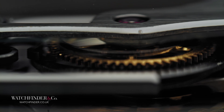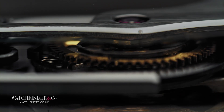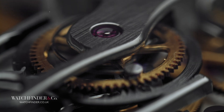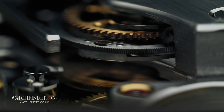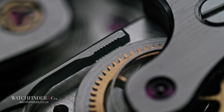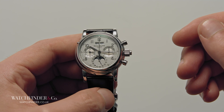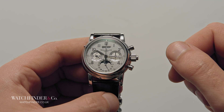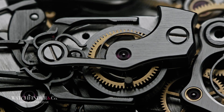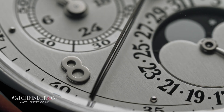Here is how it works. The drive from the chronograph second hand turns a cam — similar to the cams that reset the chronograph — which has a little notch in it. In that notch sits a ruby roller on a lever, which itself is connected to the split-second wheel and held under tension with a spring. When the split-second wheel is free to turn, the roller sits in the notch of the cam and receives the drive from the chronograph seconds, synchronously turning the split-second hand. When the split-second wheel is clamped still, the cam continues to turn, with the sprung lever allowing the ruby roller to simply roll out of the notch, going around the cam over and over again until the brakes are released. And when they are released, the spring in the roller lever forces the split-second wheel to follow the shape of the cam — again just like the reset cam in the main chronograph — sending it back to its little notch, synchronising the split-second hand neatly back under the main chronograph hand.